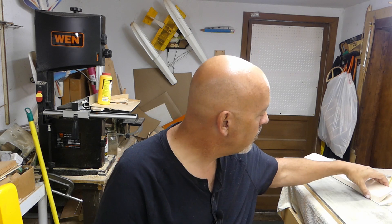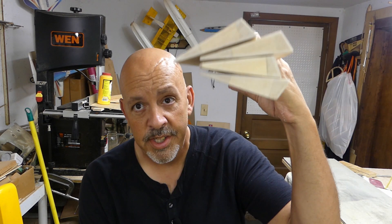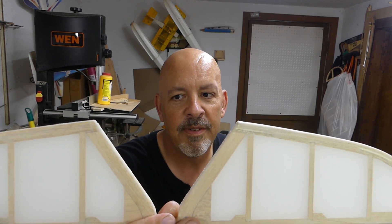This 400 grit works very nicely for fine sanding — you end up sanding the fibers down. We got all the ailerons done, and the ailerons — you think ailerons are easy? These things were a gem. The first time you do it, you're going to find out that's probably not the best way. By the time I got to aileron number three I had everything panned out, and three and four went real quick and easy. These were about an hour and a half a piece — about 45 minutes a side. The rudder and elevator took about 45 minutes to an hour each. When you look at all these things put together, that's a full day just for those parts.